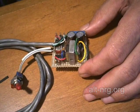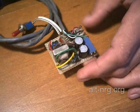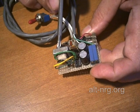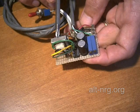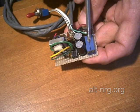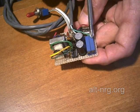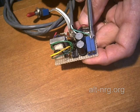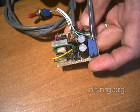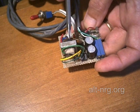Some folks have told me that they've only been able to get maybe 150 millivolts at the most coming out of the secondary of the triad transformer. That's possible because it is a lower impedance device. So the trimmer potentiometers that I was using, which are 20K, may have to be adjusted. You might need to use a 100K or a 200K trimmer potentiometer. What I do know is some parts values of this device are going to change to accommodate the different transformer.